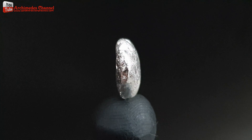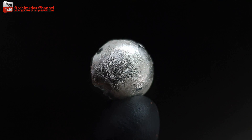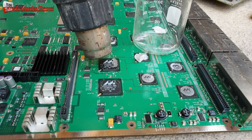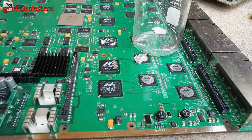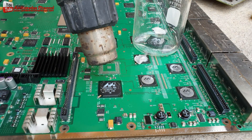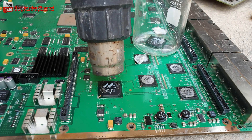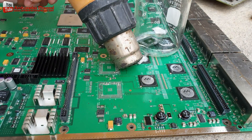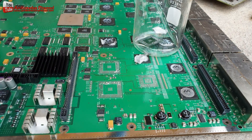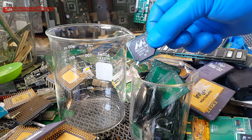Lead-free solder is mostly silver, tin, and sometimes copper or other metals. The temperature required to get a lead-free solder alloy into its molten state is higher. PB-free solder materials are used in various parts of interconnections in electronic packages. The first level interconnect is between the chip and the package substrate. Lead-free solder bumps are used in the case of a flip-chip BGA, FCBGA, where there is a silver mix in the solder ball.